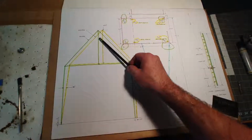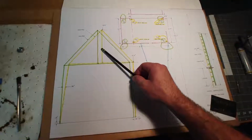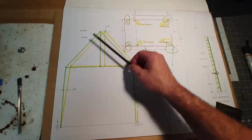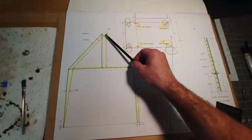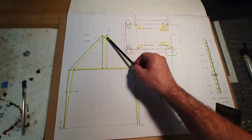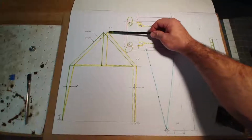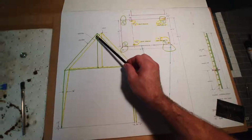So this bisecting line is done at 90 degrees here on the green triangle to its base, and this bisecting line went up at 90 degrees to the yellow triangle's base, long. Then I measured the length of a green side, and I started at this corner and went up and down this backbone structure, this bisecting line, until I got to that length, and I put the point there. Then I came from that point to here and connected them, and I checked that length versus the green length, and lo and behold, it's the same again.